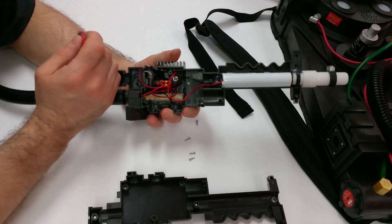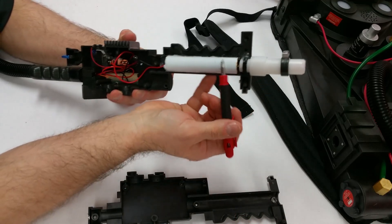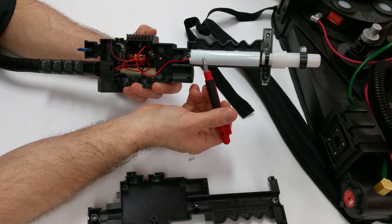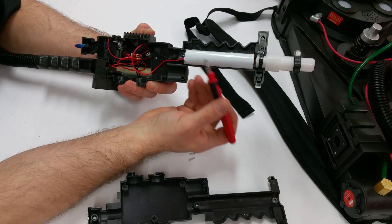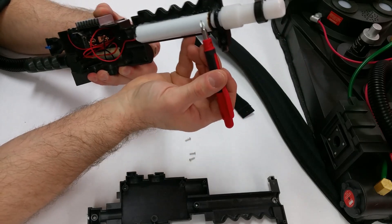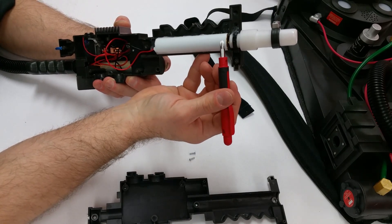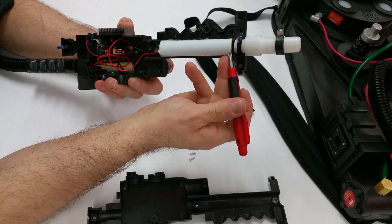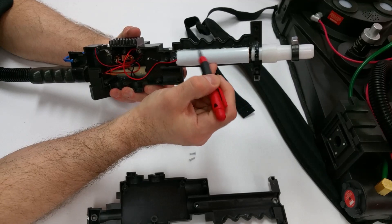What we're really concerned about right now is how we put the laser in. The laser diode is at the end of this tube — this is just a piece of metal tubing, probably very thin steel, from a mop handle I got at the dollar store. It perfectly fit the two-watt diode right inside there. I then had to take some really thin sheet copper and wrap that around the diode to make a nice tight fit into this tube. That was important because really the only thing holding this tube in here is hot glue.